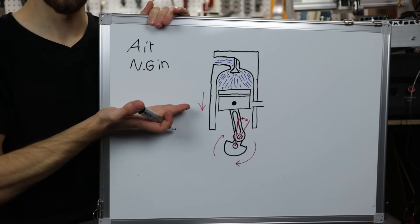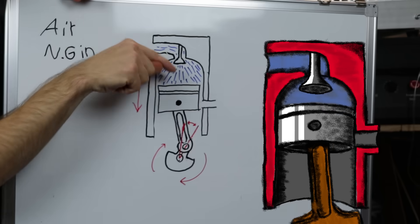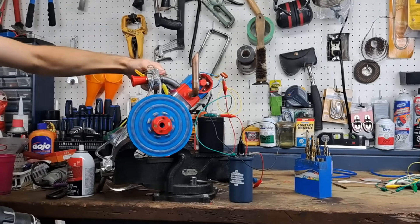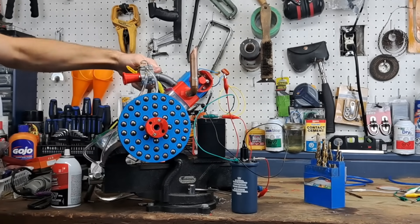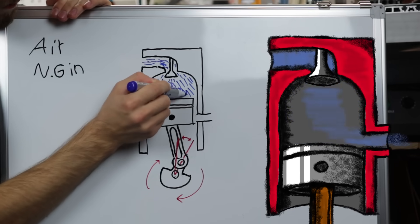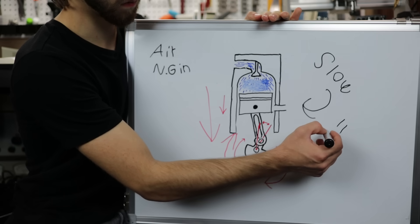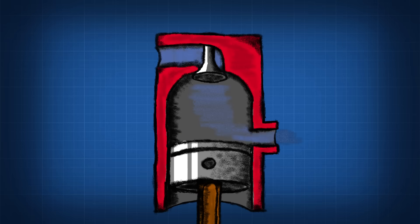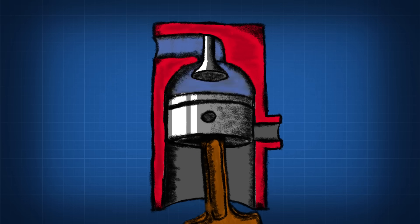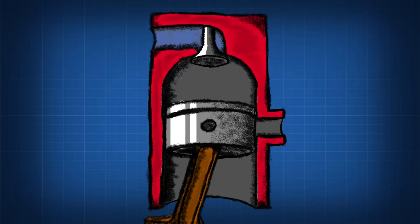In the case of an air engine, when the intake valve is open, air will flow into the cylinder and generate pressure, which forces the piston downwards. What makes this unique compared to a combustion engine is that even when the engine is under heavy loads, instead of stalling, air will continue to flow in and keep pressurizing the cylinder. But the biggest flaw with this design is the engine can't rev very high, because as the engine speeds up, the piston is already on its downward stroke by the time air starts to flow in, so it doesn't get a chance to pressurize — it's sort of just blowing on the piston.